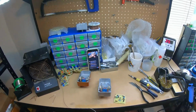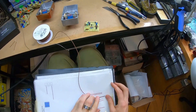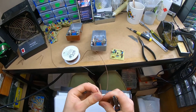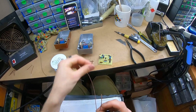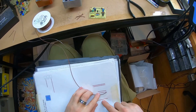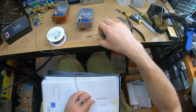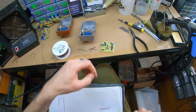For that I'll need some wires. Three of these. So this is in, out, and LED, which is pretty much the ins and outs of the foot switch as they relate to the circuit board. I won't need that because that normally goes to the big 10mm LED. This one doesn't have one. That goes to the ground via the input jack and to DC positive.